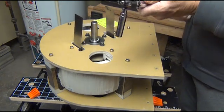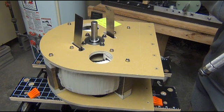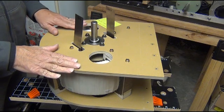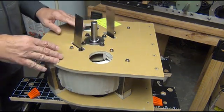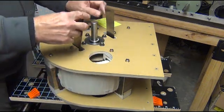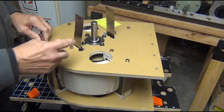We're going to tighten the end plate down to 65 inch-pounds of torque on these. I've already tightened these bearings in place — I had it assembled and put it together. But normally when you're doing this, the bearing bolts will be loose. The hardware would be in place but not tightened, so that when the shims are in there the rotor will self-align. And then when you get the shims in there, you tighten the bearings down.